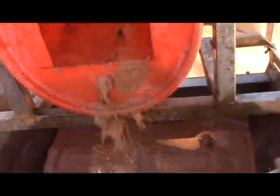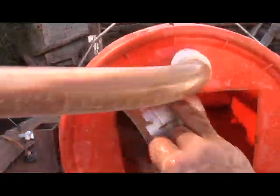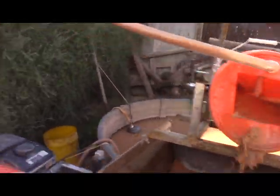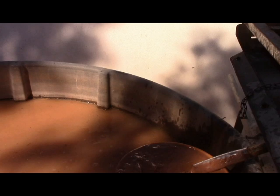The new running procedure: after putting in a new ore bucket, take one scoop from there, one scoop from there, and check the tailings bucket. The tailings are also showing a substantially reduced amount of gold. So the second run — gosh, the recovery's got to be in the upper 90 percent in terms of what actually wound up in the tailings compared to the free gold in the head grade.